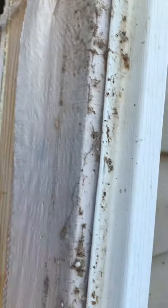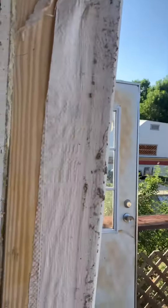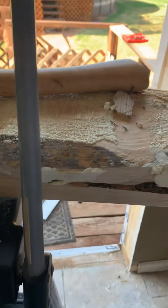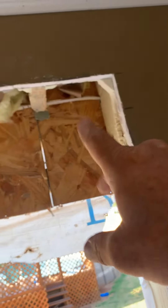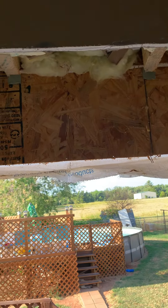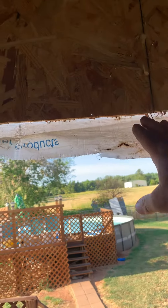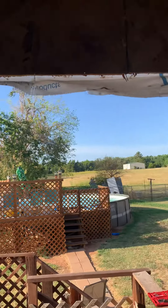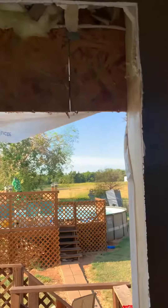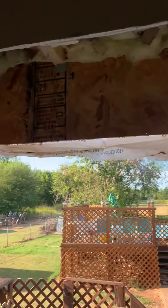So I'm going to have to take all this out. We'll reuse the header to get it nice and good — it's a thick header. I cut the pillars out. The header will basically go right up to there, and once the header's in and that backboard right here is gone, I should be able to slide the door right in. So that's a start — let's see how it goes.